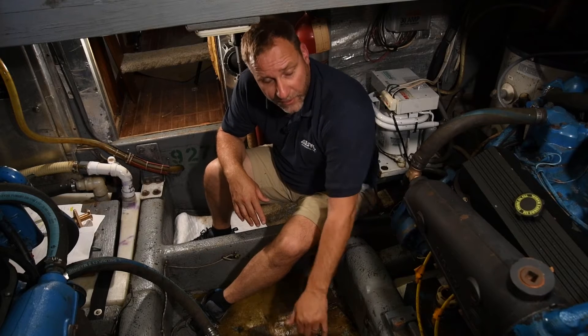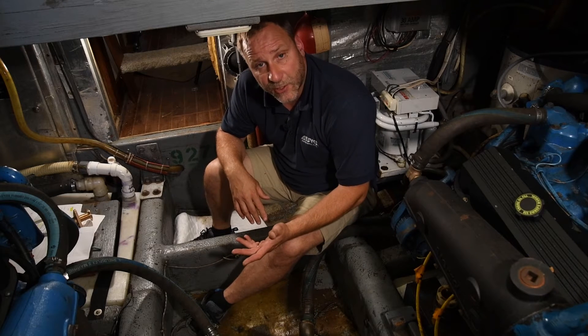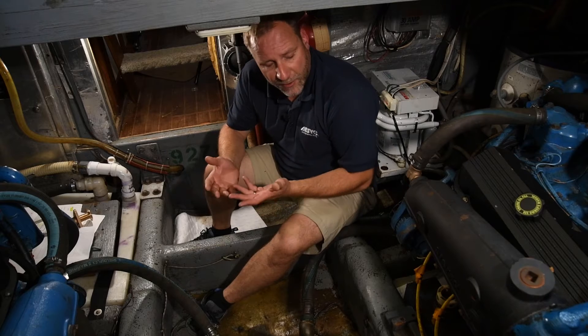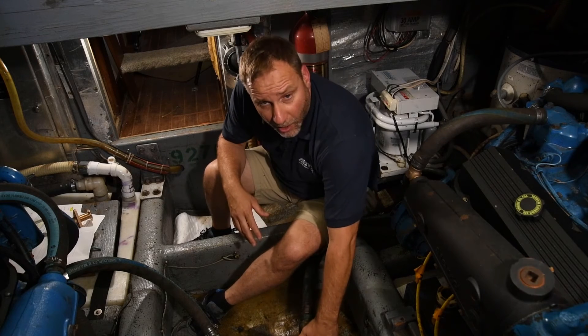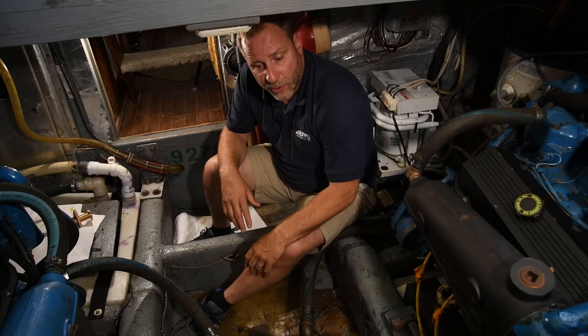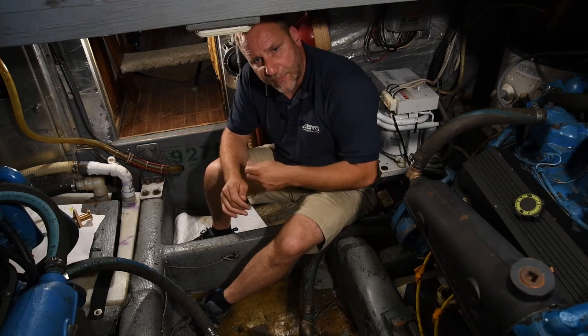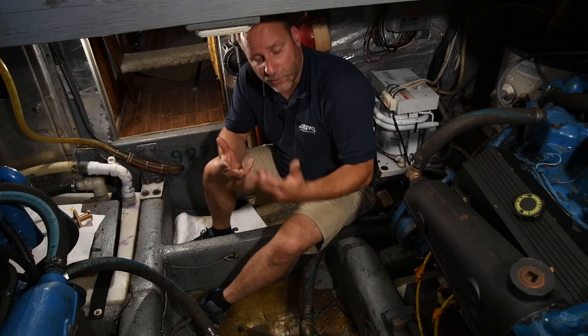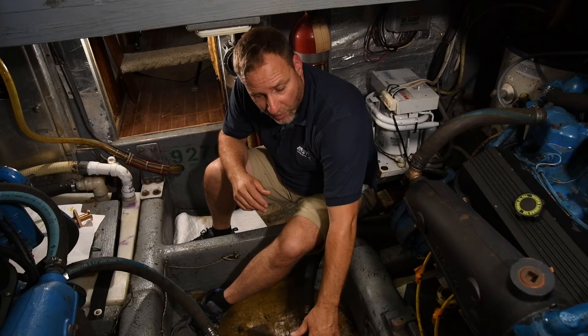We could take the hose off and look in there too if we need to. That strainer is also something that needs to be serviced. Some of these strainers underneath the hull are going to have anodes attached to them that will need servicing to protect from underwater corrosion. Also, these strainers a lot of times are painted, and over time people paint and actually paint the holes closed in the strainer, so you've got to make sure there's good water flow coming through there.